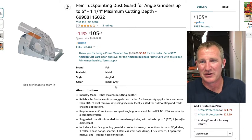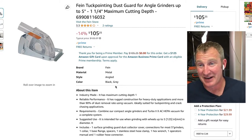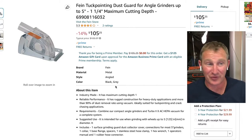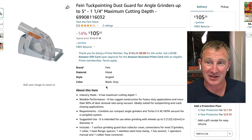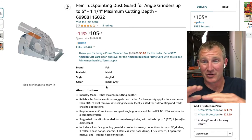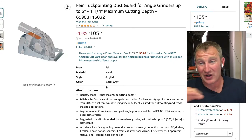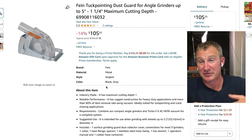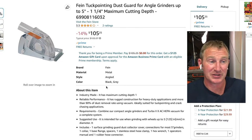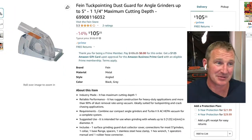You can use that blade to scribe cut right there in the space. On your shower floor at the edges of corners, there's often buildup from waterproofing, and it slopes up in the corners a little bit — which is good for drainage. That's where the dust shroud grinder really helps: you can do it right in your space without running down the steps.